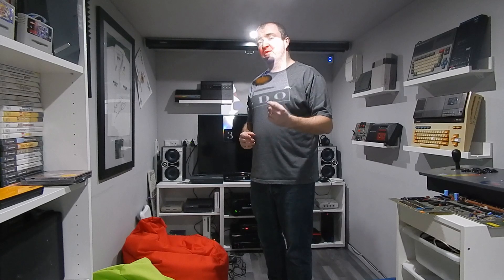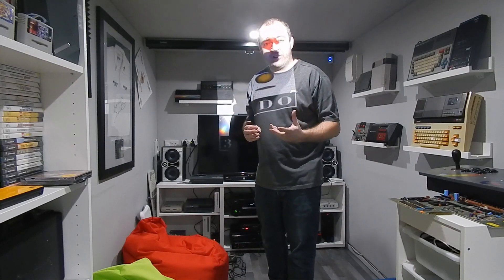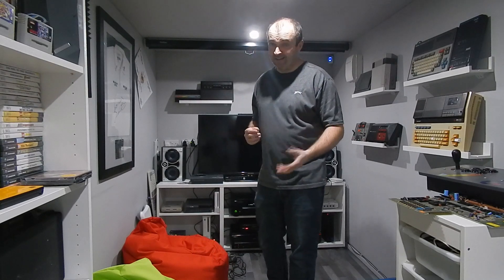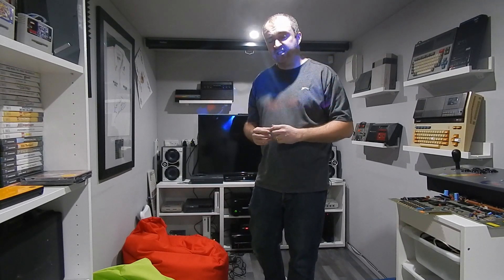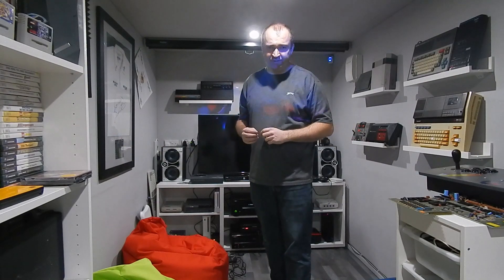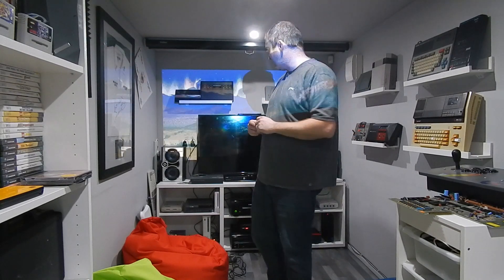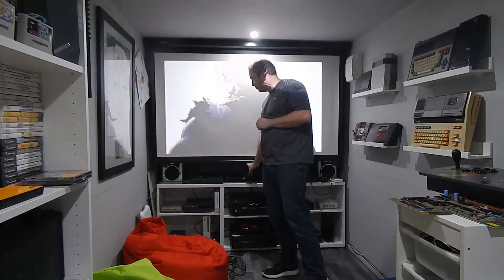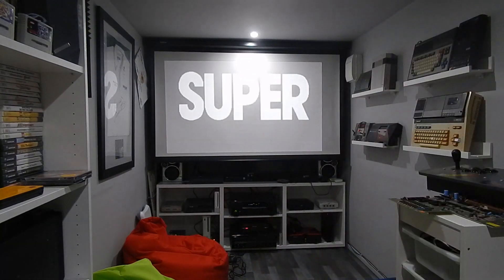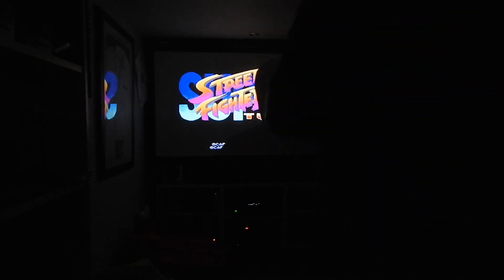Well, that's it finished. It does improve the picture quality slightly, as we've seen in the close-up captures. Is it worth doing? Well, it is quite an easy mod after all, if you connect everything up to the right pads — so I think personally yes, it's worth it. You can do an RGB mod on this console as well, albeit that is slightly more involved with quite a few wires to solder onto the board. It's something I'll maybe look at doing in the future, but for now I'm quite happy that I have my video working in 240p. See you next time.